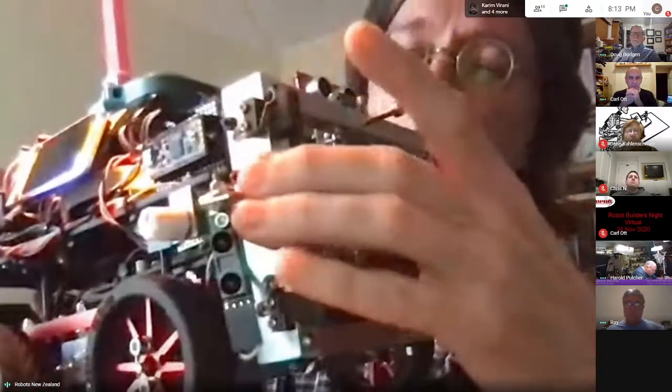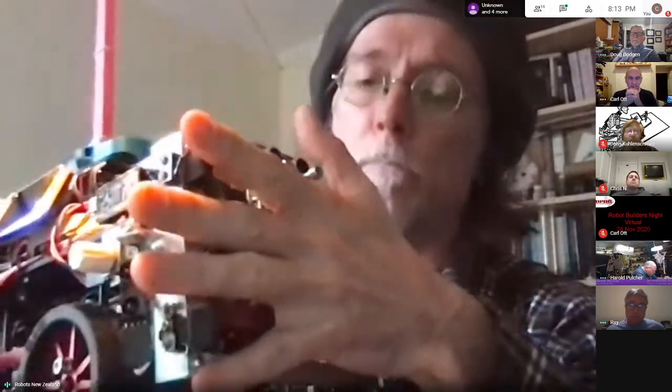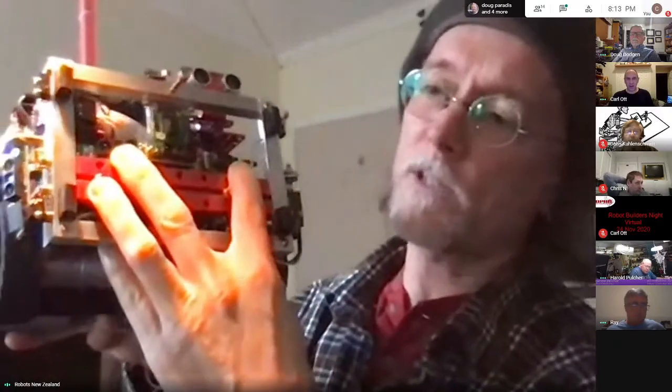And the nice thing, I'm not going to take it off, but this whole front sensor, the whole front bumper, which has these little micro switches for the polycarbonate bumper, the side, center and oblique infrared sensors and the camera, apart from the camera, all of that is now on its own IO expander, which is a little tiny microprocessor. And so between that whole front sensor apparatus, there are only 4 wires now going to the robot: power and the SDA and SCL connectors. So the whole front of the robot is all I2C. And that's all working now, and it works pretty well.